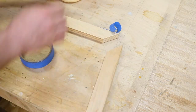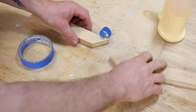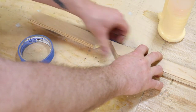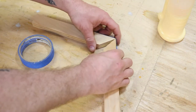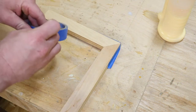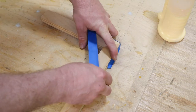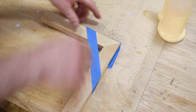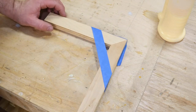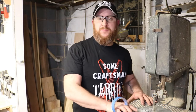The way you do this is very simple: take a piece of tape, go a little long, get it nice and solid on there. Take your glue, put it on the joint, put the two ends together, stretch the tape out, and when you pull it in, that tape is going to naturally pull it to a nice point and make it tighter. Then roll another piece of tape in on itself and clamp it like that. If you're doing a complete picture frame, four of these will hold it all together. Let it dry and you've got yourself a glued-up joint using only painters tape.